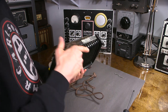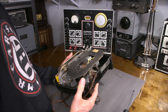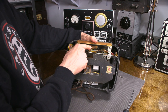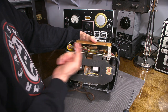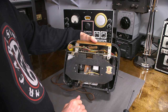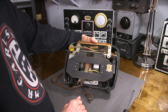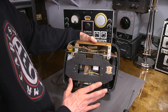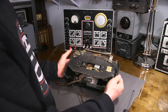Inside here it looks like the tubes are mounted upside down, so this chassis must have just been baking - which brings me to these wax capacitors. All these have to be replaced, but these are on the upside so these things have been baking in that vacuum tube heat for a long period of time. It'll be interesting to see if this thing starts up and operates just the way it is. Whenever you get an old radio like this, it's never a good idea to plug anything like this directly into the wall outlet - it needs to be tested properly.